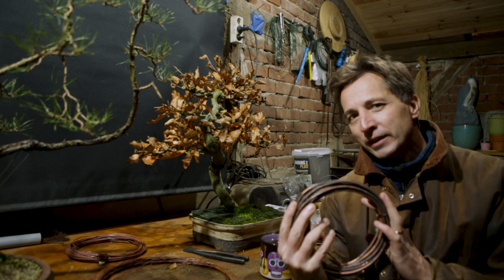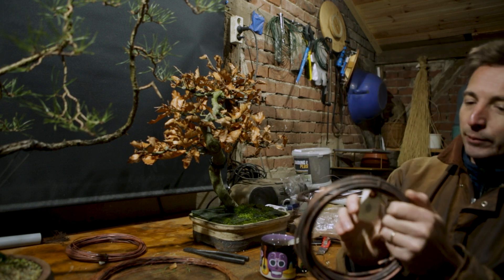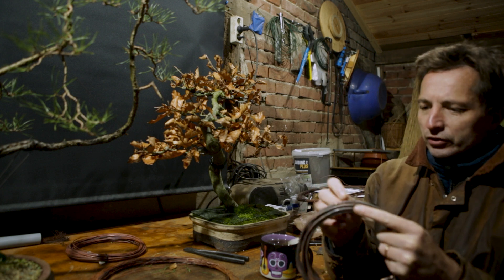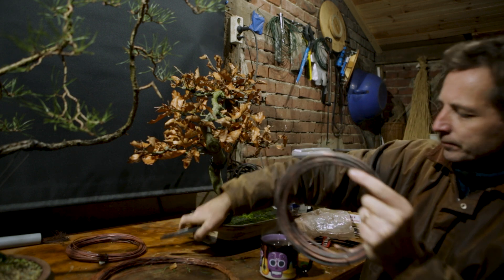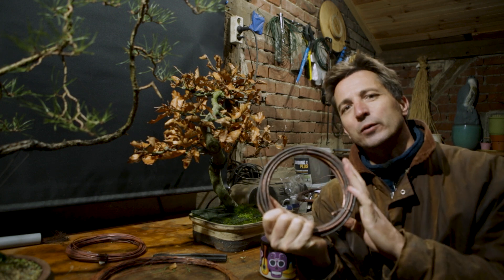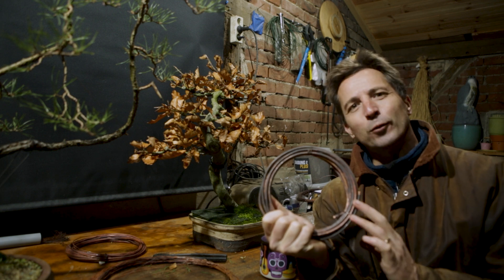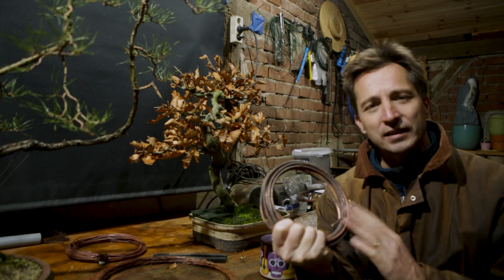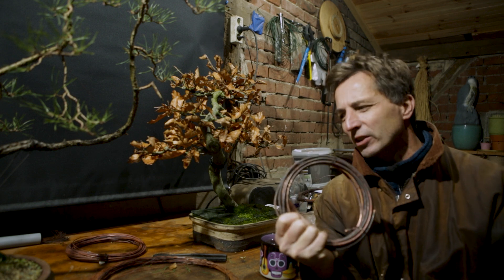I don't know whether my grill will reach it. I've lit all the coals and now I'm just going to take this — taking the label off because it's one kilogram of five millimetre wire, and I'm going to use that later. What happens when we heat this up to 400 Celsius is that all the atoms in the wire will realign. I let it glow until you see a dull glow, then once it is glowing I take it out and let it cool. You can dump it in a bucket of water — at that point all the ash will come off and it will be nice and red again. But I don't have a bucket of water nearby; it's two degrees Celsius, almost freezing, so I'm just going to put it in and lift it out.